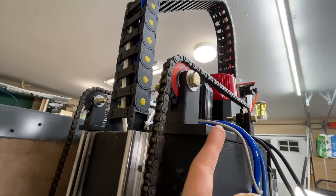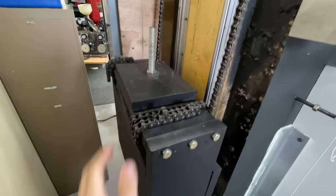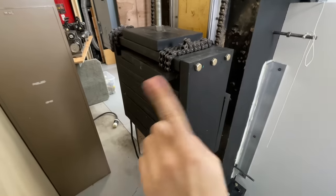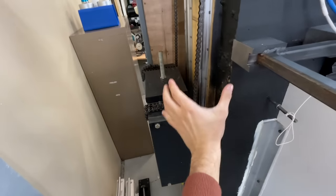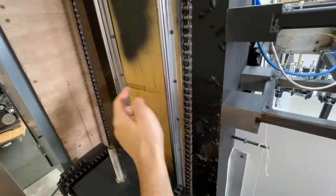We attach this with chains that span all the way from the z-axis frame around some idler sprockets, mounted into a slotted steel block with a bolt through it. The chain travels all the way down to our 200 kilograms of pure hot rolled steel — we used hot rolled steel because it was the cheapest form available locally. To prevent the counterweight from rotating or swinging back and forth, we mounted it to these linear rails on the back, which are a super cheap and great addition to this mechanism.